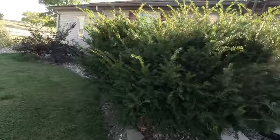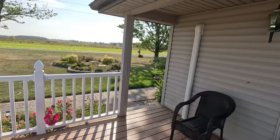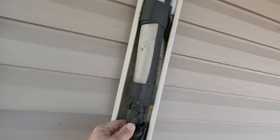Let's go see if this other one over here is the same way. Look at that — the other one's on the outside wall too. So that means that flare fitting's way down here also, which means old Rickster there didn't pick up a leak that was behind the unit. Leak detector's a pretty darn good one, but I'd say it probably wouldn't pick up a leak on a flare joint all the way outside. No sir, I would say probably not.